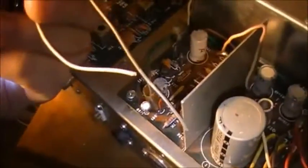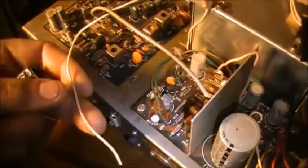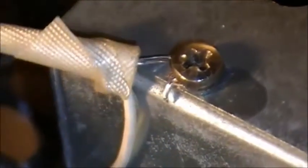It's kind of curious. This is the speaker wires here. I've got them disconnected from the unit. Somebody put an add-on speaker on the radio a few years ago, and they've got audio going to chassis ground. I don't know, but I'd be looking at that. I'll have to see if I can dig up a service manual somewhere for this thing.